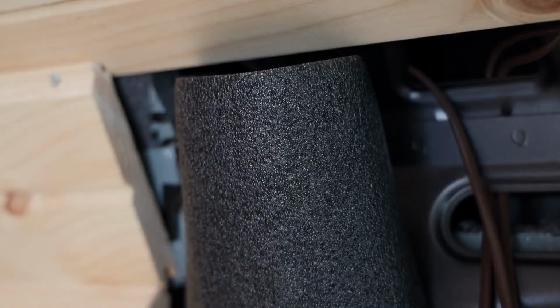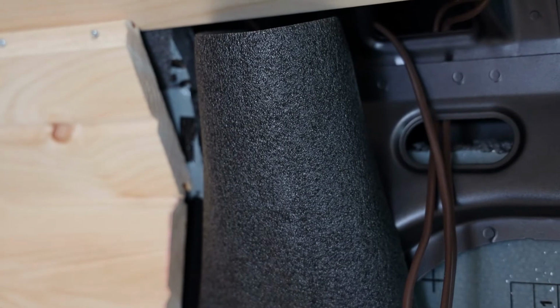And in layering up the EPS sheets, remember how I said that it should be accurate? Turns out that it was quite difficult to get these cuts as close to the edge as possible, and we had to use a lot of pieces to fill in the side, especially when it was a little bit bigger and the foam spray insulation wouldn't work so well. Since the EPS sheets that we installed had some sizable gaps around the edge, then we had to fill those in with whatever scraps we could find.